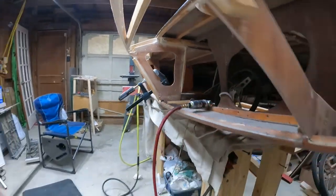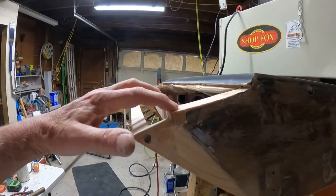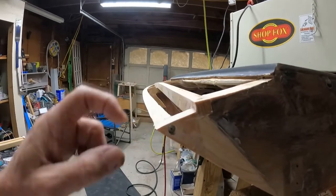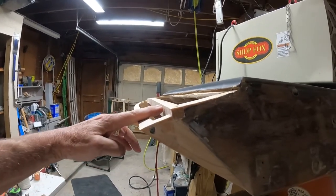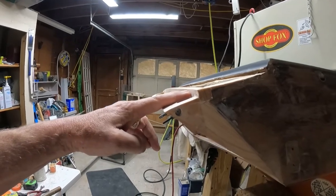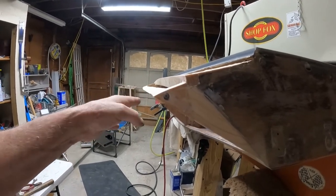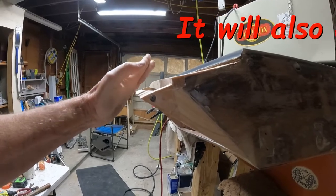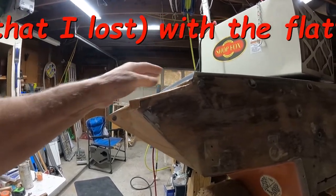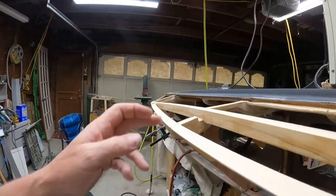This morning I've got several things going on. I've been sanding on the frame, trying to get it faired up, getting it like I want it, filling in little holes with thickened West System about the consistency of peanut butter. I'm liking my second non-trip here — it's pretty unique, not a common shape I've seen in the past. I think it's going to shear off the high waves and stop them, going down this way rather than just building up and causing a burble and making it hop. I want that boat to come in smooth and stay smooth.